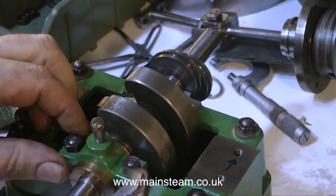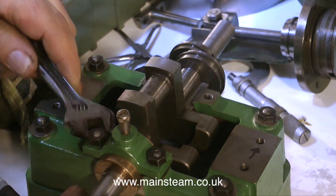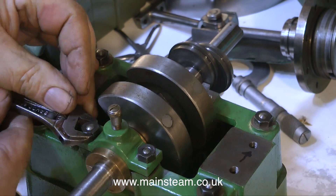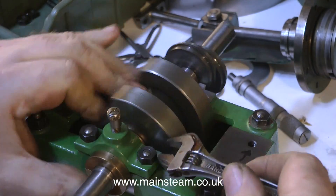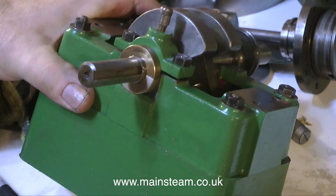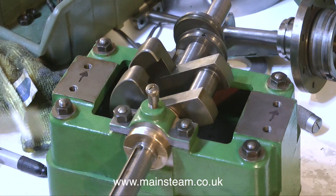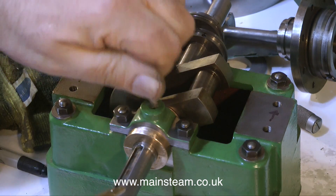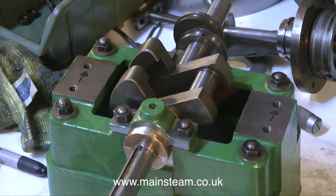If you look at the small oil fitting sticking out of the top cap, that's not even the right thread to screw into the top cap — I'm going to look at that very shortly. What I do notice is, as I'm tightening up these nuts onto the top cap, at one side the nut is fouling the curved part of the top cap itself. So I removed the top cap, removed some metal, and refitted it. Now both of the nuts are completely flat on the top cap, and the cap in turn is held squarely to the bed plate.